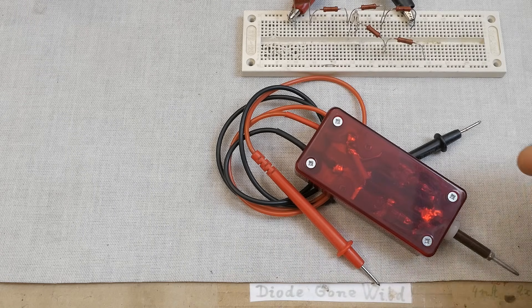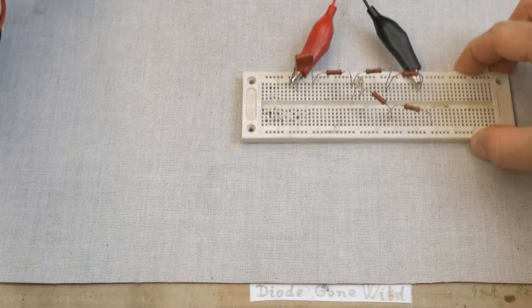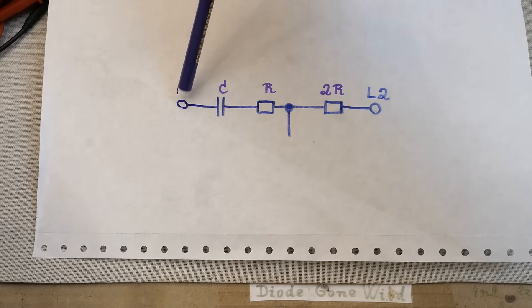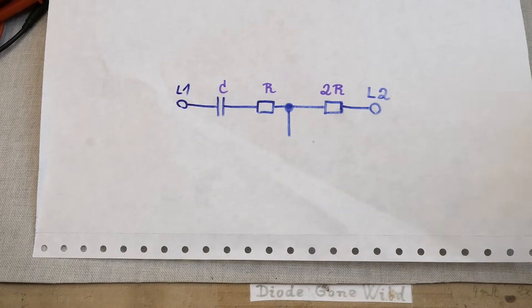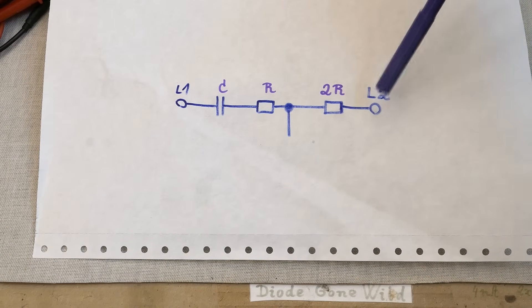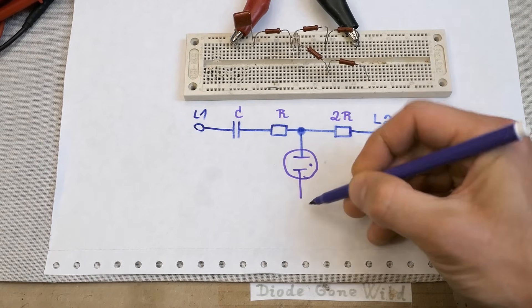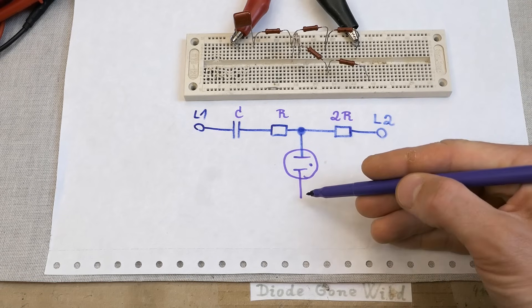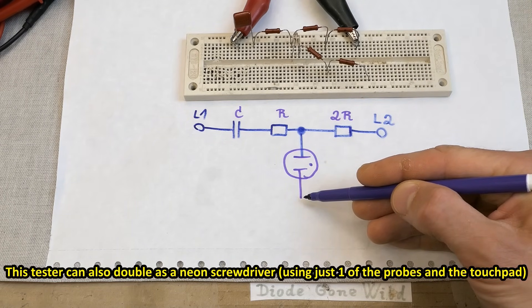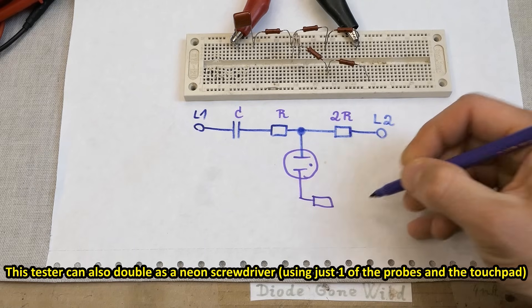For people with just two hands, there's a two-phase version. It basically probes two phases and can tell you which one goes before the other — which is enough to determine the direction of all three phases. It's a circuit with two legs: one with just a resistor, and one with a resistor and a capacitor as a phase shifter. If one phase leads the other, the center point has a significant voltage against neutral; if the other leads, the voltage basically cancels out and the spot has virtually no voltage against neutral. You can add a neon lamp there connected to neutral, or add a touchpad and use the same principle as a neon screwdriver, where the human body acts as the neutral connection. With high enough circuit impedance it should be relatively safe, and you can add more series resistors for extra safety.